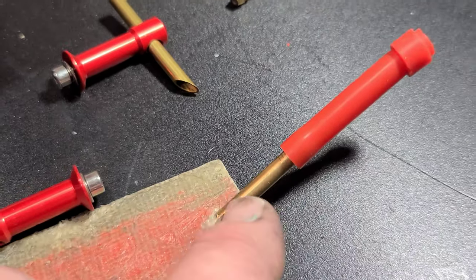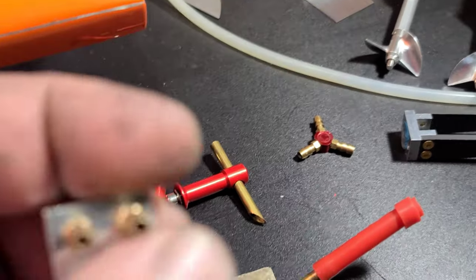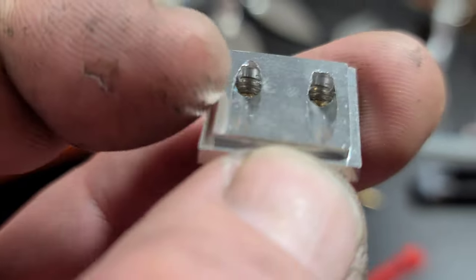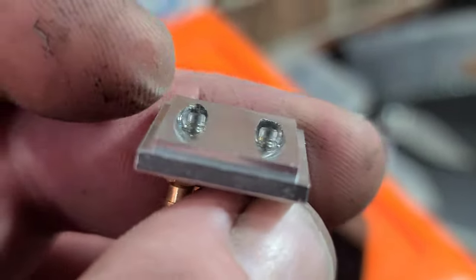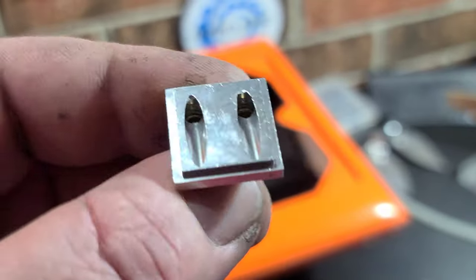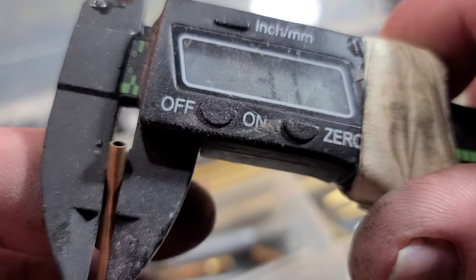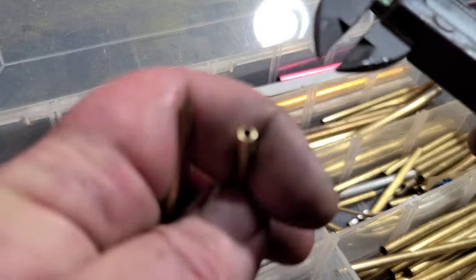That being said, I'm going with the flush mounted DIY. I'm not going to use the big pickup that came with the Oxte marine pickup - I have that just for reference. I think we're going to go a little bit smaller with the brass tube. The hole on these nipples supplies plenty of water to our electronics, and I actually want to try to go smaller with the through hole so I don't have such a big hole in the bottom of my boat. I found a 3.1 millimeter brass tube which is an eighth of an inch, and a 5/32nds - 3.9 millimeter - so kind of up in the air between these two.